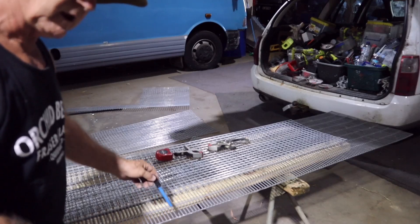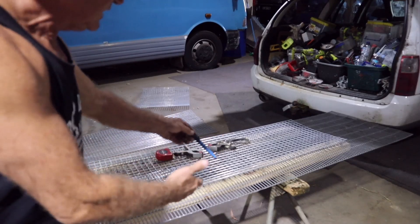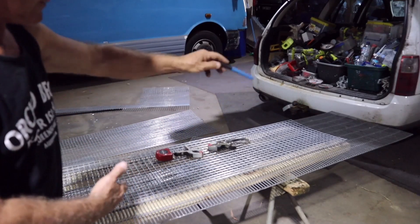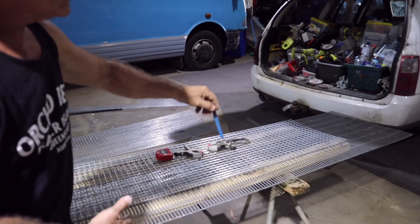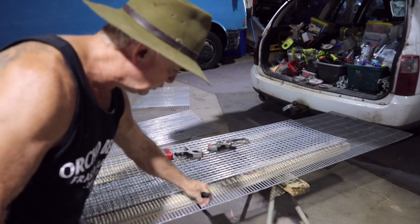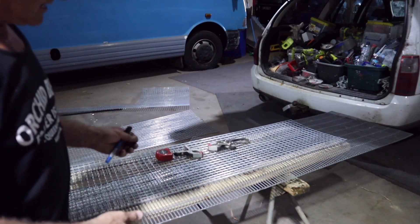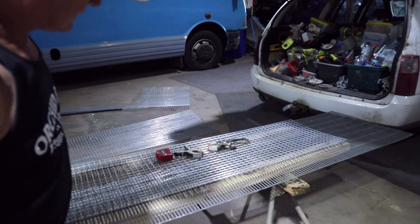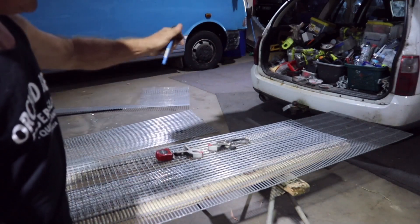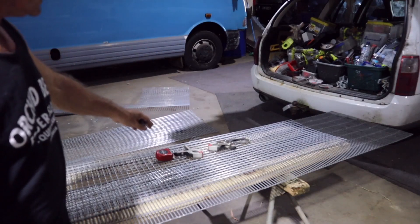This was specially made — he got it at a good price, bought it in bulk. So I don't want to cut it down. I thought about it because it's 3.8 meters. If I cut it down to 3 meters, I have 800mm left, so I put them together and end up with two bars there, and it's more likely manure will get stuck on. So I'm going to go with 3.8. The cage is going to drop 50mm shorter and I'll end up with 950mm cages, which is standard anyway.